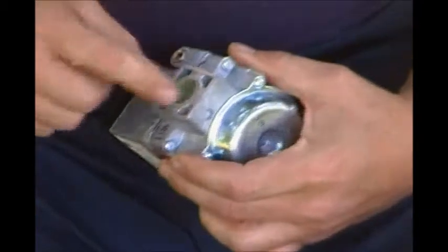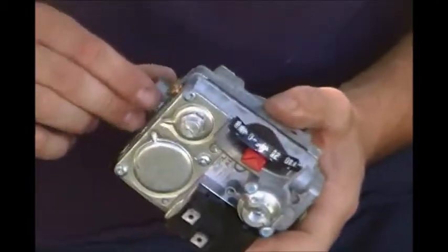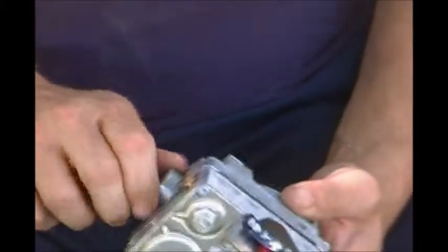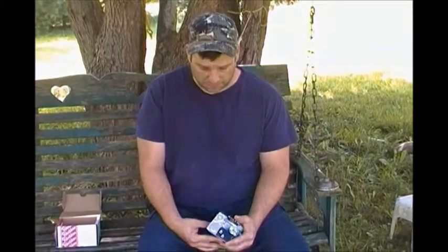This one's half-inch to three-quarters, but if I want three-quarters to half-inch I have the adapters right here. Most of the time when you're replacing them it's half-inch gas pipe feeding it, and three-quarters is on the furnace itself going to the gas burners.